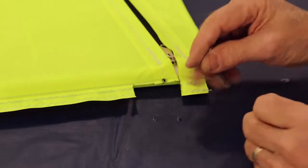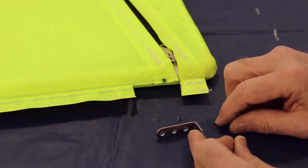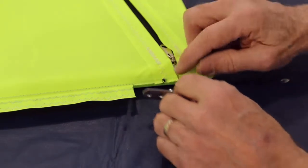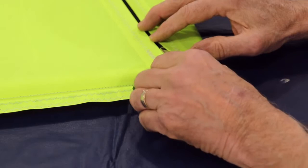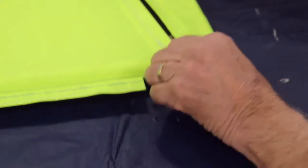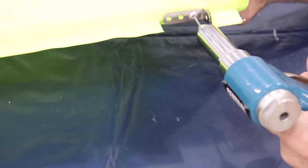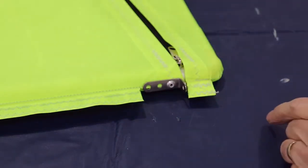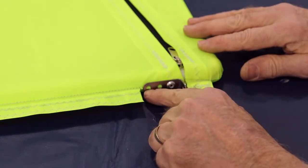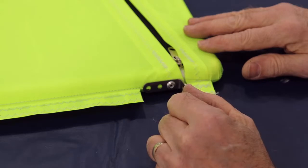It's the same on all hinges. The pilot hole in the hinge is the one closest to the bend, and that gets riveted to the pilot hole in the control surface. Once we have this lined up, we will come back and back drill these two holes and rivet them also. We will do that the same on all the control surfaces.